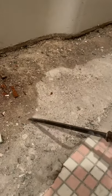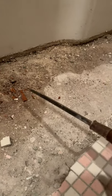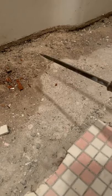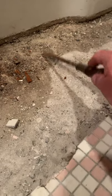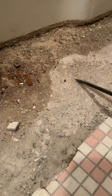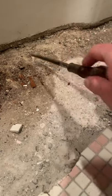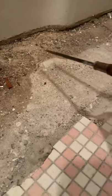You can see this wet line right here — it just follows the shape of the tub. Last night I jackhammered up this bit of floor just trying to get a view of what was going on. This wet line wasn't here before — the floor over here looked just like the dry floor. It's leading me to the conclusion that we still have something in this area that's leaking water out.